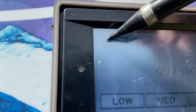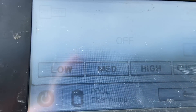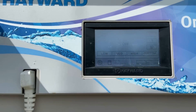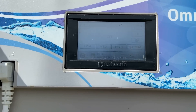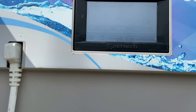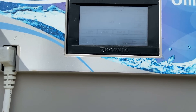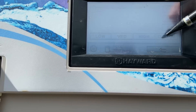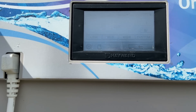I'm going to go ahead and stop it again — see, I just turned it off and that stops the pump. That's how you deal with the OmniLogic system. Always prime the pump back up on high, then you can leave it in high and the program will take over later, or you can turn it back down to a lower speed like medium, or hit custom and set anything you want — 75 percent, whatever.